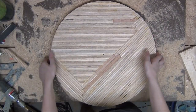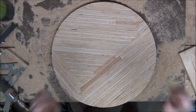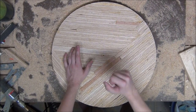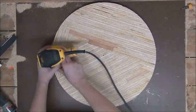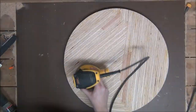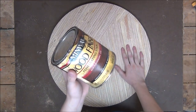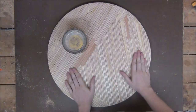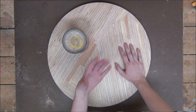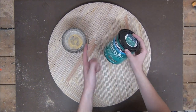That is looking pretty good — I'm really starting to like this. However, we are not out of the woods just yet; we still have a whole bunch of sanding to do. So let's get on that. Now I'm going to go ahead and stain it with red mahogany 225, hand sand it just a little bit after the stain has dried to give it more of a rustic matte finish, then put on a protective clear coat to help seal the deal.